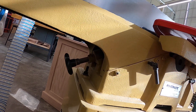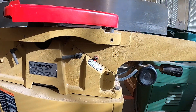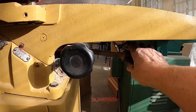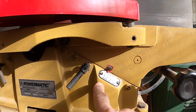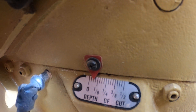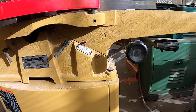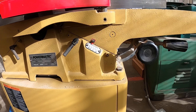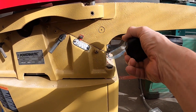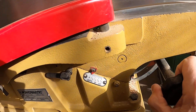You can see there are adjustments if it were out of alignment, but to keep it in alignment we don't want to touch those. On the infeed side, we would unlock here and here — lefty loosey — then we've got our handle that will move it up and down. Right now I've got it set at a sixteenth of an inch, which is recommended. If we wanted to take off more because we had a really crooked edge, we could take it up to an eighth inch, which is maximum for our program. This is how we adjust it with the handle once it's unlocked.